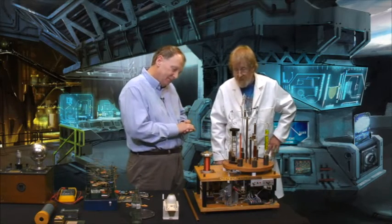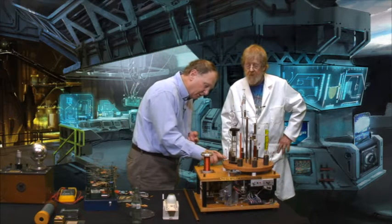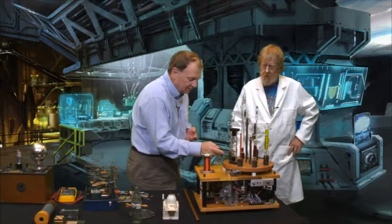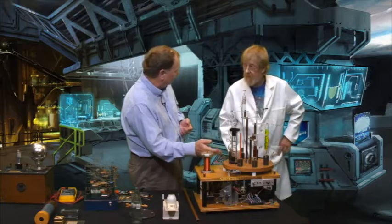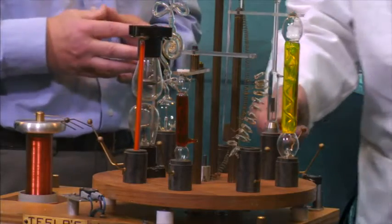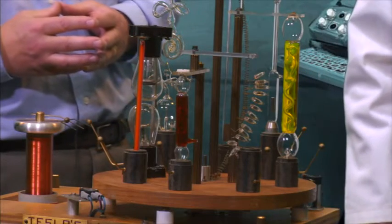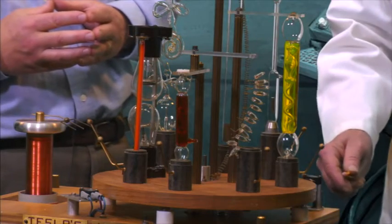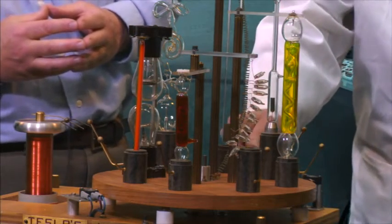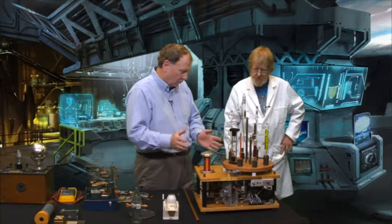What do you call these parts here? Those are just electrodes. Are those electrodes that you fashioned yourself? Yeah. So you had wire and brass balls — I got brass balls, put them in the lathe, put a blind hole in the ball, got the brass rod, bent it, put the balls on the wires, and soldered them. The symmetry of this is really a work of art.